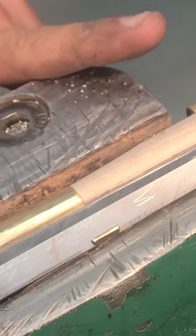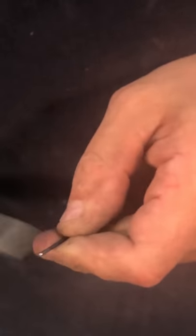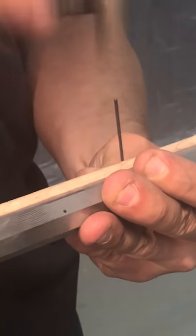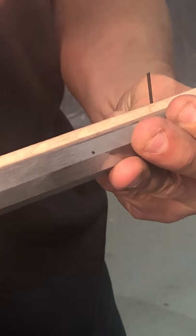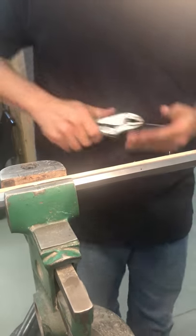That one did pretty good. I stopped it purposefully — I didn't go clear through the stock — otherwise the pin fit can be even more troublesome. Going to squeeze the barrel into the stock again for the next hole and repeat the process. And then the final one at the muzzle — you have to be a little more careful since you're squeezing on that front sight. We could just take a pin, file a lead on it, and install it. But we're going to go one more step to make this gun a better shooter.